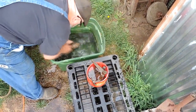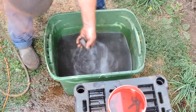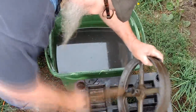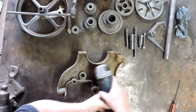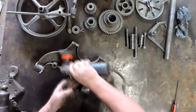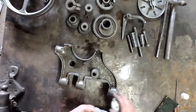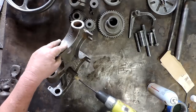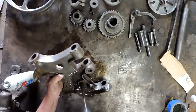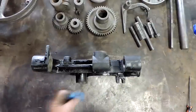This is again another seven days later. The bucket — that tub — is full of water and baking soda, so it'll neutralize the vinegar a little bit. I hand-scrubbed and wire-brushed each and every part. I was very surprised as to how clean all these parts came out. My little hand wire brush just couldn't get in all those cracks very well, so I did a lot of this with the rotary wire wheel. Then I used a little 300-grit sandpaper and some WD-40, just cleaning up where these shafts ride, getting as much of the rust and surface pitting out as I can without taking too much material off. That worked out pretty well — I was able to hone those out pretty good.